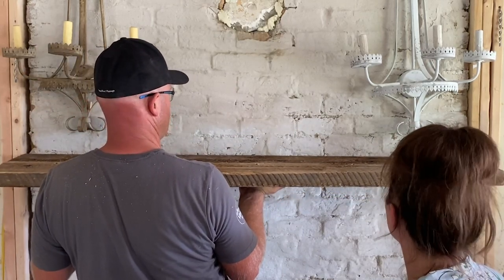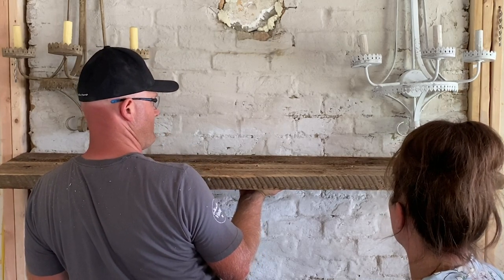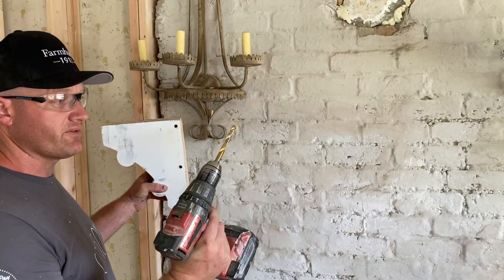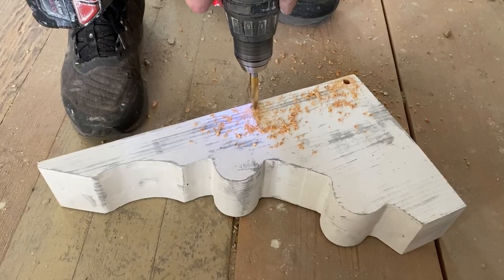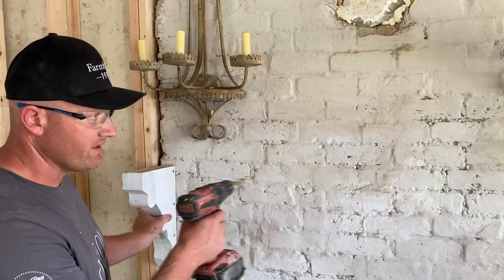We can go up one since we got rid of those things — so that's a good mantle height. Since we got rid of those little nubbins. What I've done here is I took a 3/8 drill bit and drilled all the way down about that deep, and now I'm gonna drill these into the side, and that's gonna hold these corbels up and the shelf.